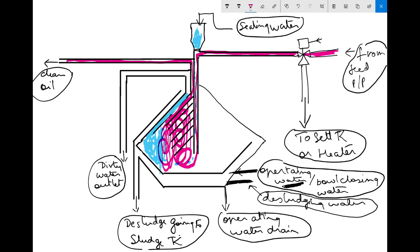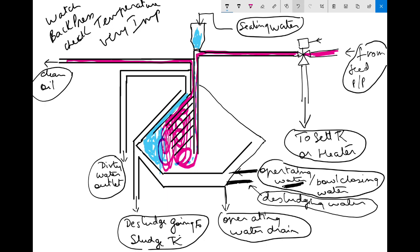Make sure you are giving the oil and check the back pressure. Also check temperatures — as the oil starts flowing inside, the temperature gauge will start showing properly. Back pressure is a very important parameter; I have spoken about this in my earlier video as well. Make sure you maintain back pressure, otherwise your filtration will not be efficient and you will just be pumping dirty oil. Maintain around 1 to 2 bar back pressure.